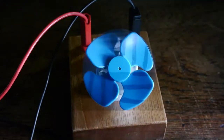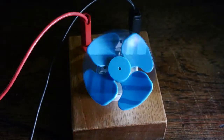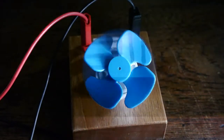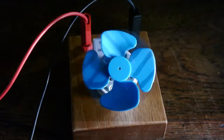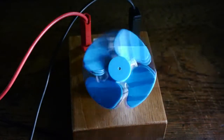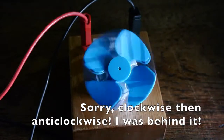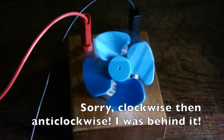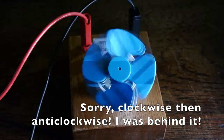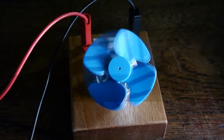I'll need to explain why you see all of the blades with their little stripey flashes on in a minute. But what we're going to do now is look at what happens when we change the frequency of the flashing light. There's our fan spinning around like mad, though on the image it looks almost stationary. I'll reduce the frequency of the light flashing on it and you'll see it appears to rotate anticlockwise. Then I'll increase the frequency and it rotates anticlockwise slower and slower. Now it appears to rotate clockwise. So this is clearly not what's happening with the fan — it's a weird effect you get when you strobe an object.